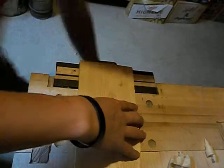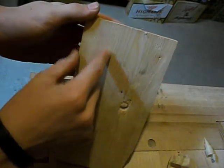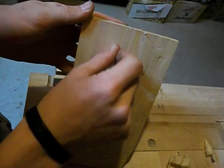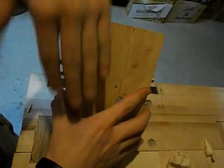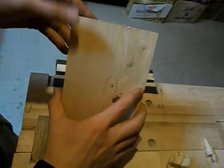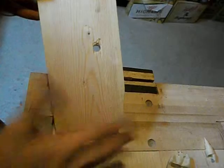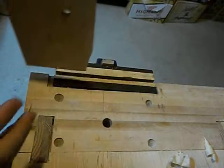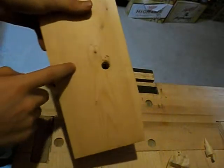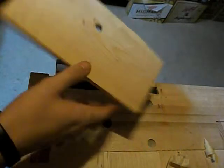This is also why I want to make sure our iron here is very straight across, because if it was not straight across, what you would see happening is that on this piece of wood where you plane it, you'd take one shaving here and maybe there was a line — that line was because the iron was digging into that side. It wasn't flat across but was digging in on one side, and so that especially when you're finishing a board is really why you want to set up that plane so that it's always flat across and not digging in on one side.